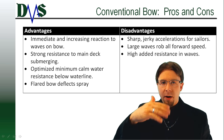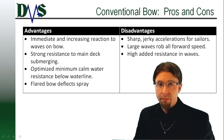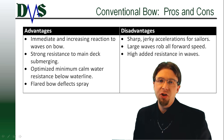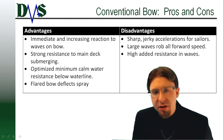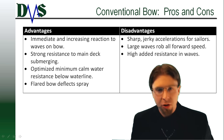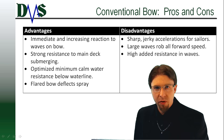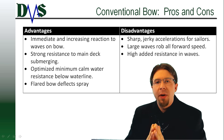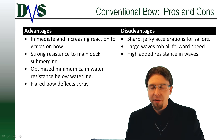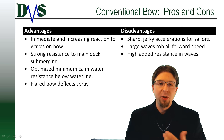The farther that water rises along the bow, the harder that the bow is going to push up, trying to avoid submerging into the wave. This non-linear reaction is also a major point of irritation for the sailors. It results in jerky pitch motions that end up fatiguing everybody because they're just too busy holding on against these jerks. To try and combat that jerky motion, we have the forward rake of the bow. This rake naturally tapers the bow to a point, which is meant to cut into the waves and blunt that initial shock of entry, but the results usually fall far short of those original intentions.